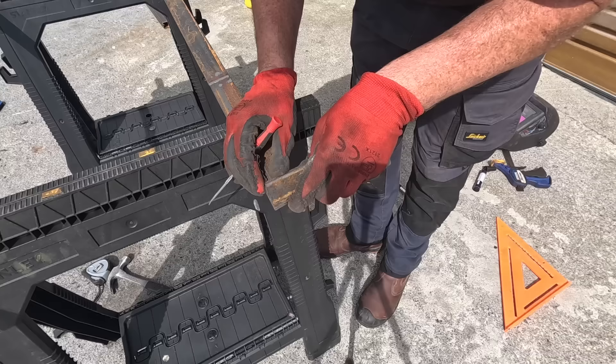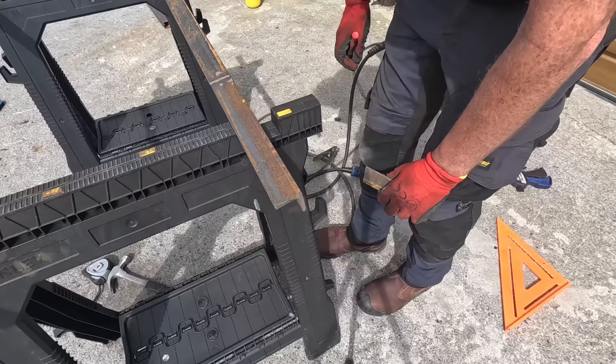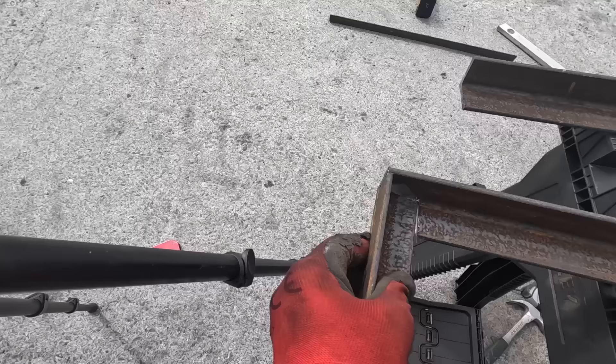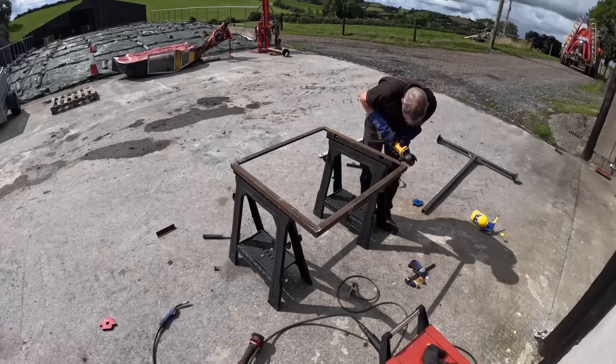Or if you have a piece of the other side on hand — this is a small offcut — just sit that over it like that and mark it. You get a perfect piece, then come along on this side and cut it with your saw so you're not cutting into the other piece — you're just taking that face side off. And there you have it: a lovely clean joint.